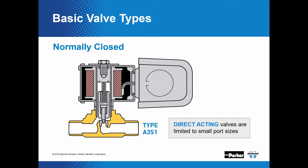Fairs, yes, you can split solenoid valves in that sense. Yeah, you want to make sure they would be equal though. So for a 10-ton system, 2 5-ton valves would handle it fine.